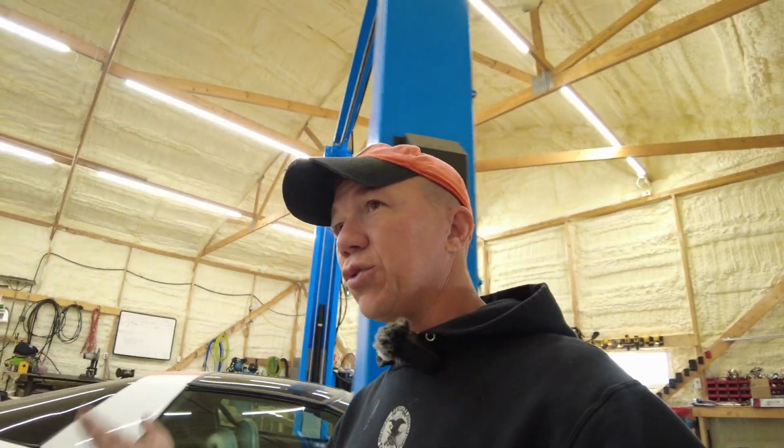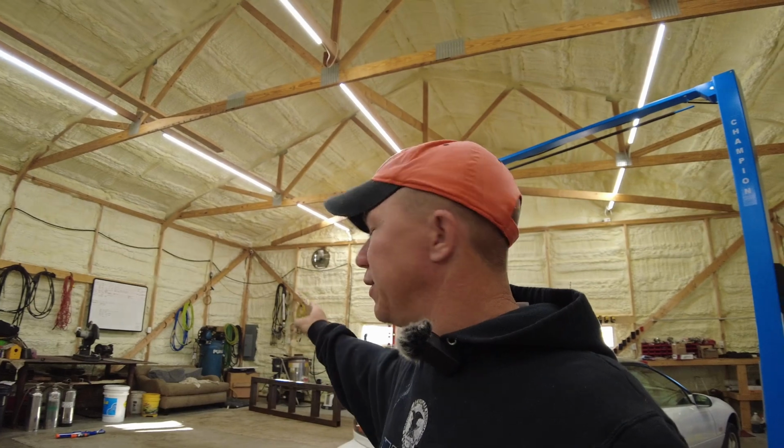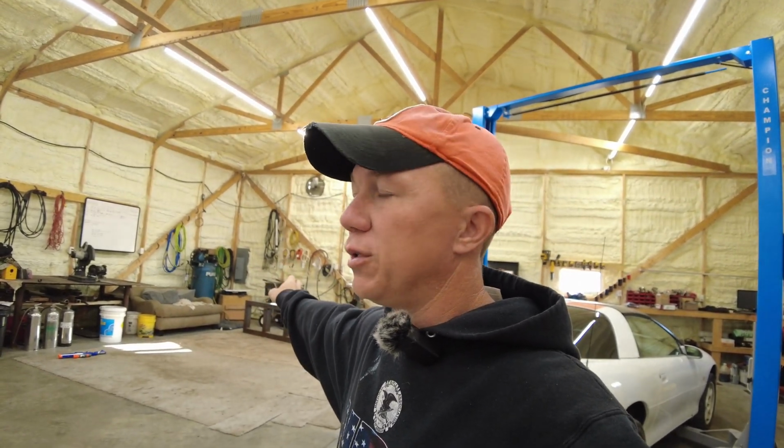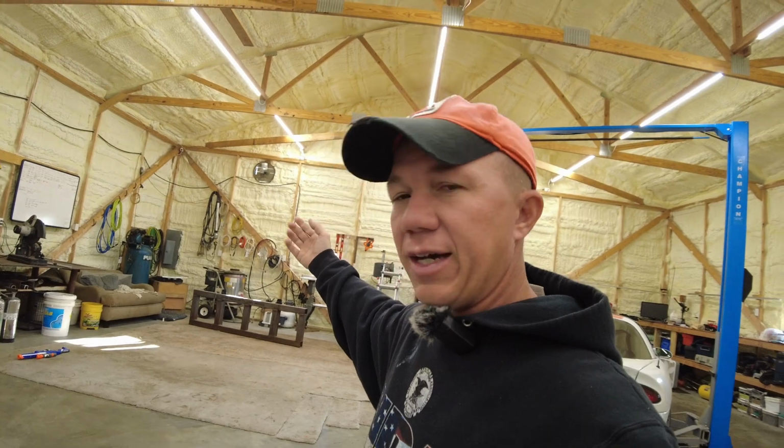Even though we probably have the ability to maintain this at say 75 degrees in here, I don't know that we will. It just depends on how efficient it is. But right now, from what you've seen on the trend charts where it's 20 degrees warmer in here overnight, 33 last night and 62 in here this morning, I feel pretty confident that the residual heat is trapped in this building, because the water from that wood boiler that we showed you outside is pumping through there all the time. So there's always residual heat coming off it, even if the blower motor is not running.